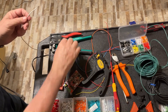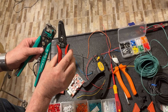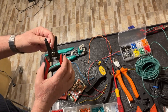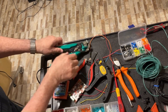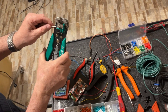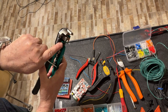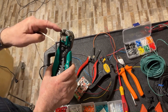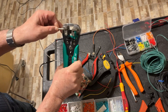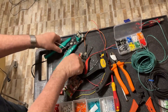We're going to see how to use the other two strippers. This one may be relatively good for thin wire, but for the thicker ones it's not recommended, even if it comes together with the cutter — so right here you can cut the wire. Similarly, this one you can cut the wire right here. Here is the stripper — it can be adjusted with a screwdriver. It's adjusted for a quarter of an inch, but it can be any other thickness you want. A quick move and the wire is stripped. But again, I'm going to use this one.